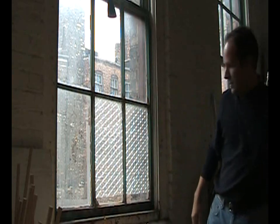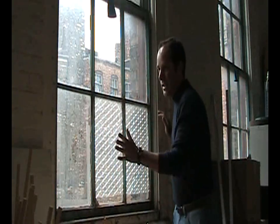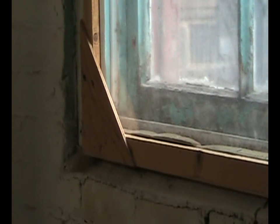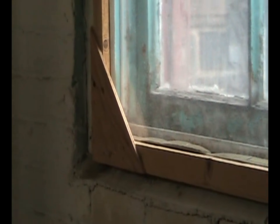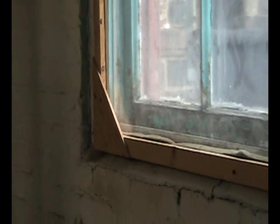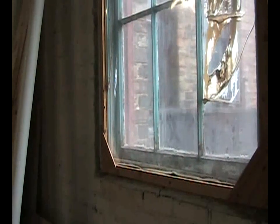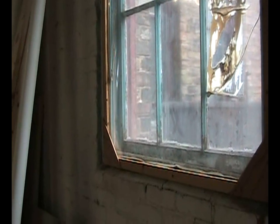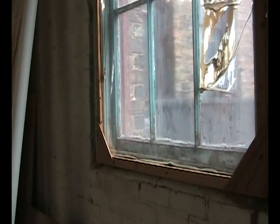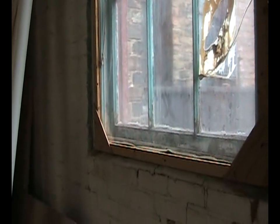The nice thing about doing this versus putting plastic over the entire window — and there are a couple of other windows in here entirely covered in plastic — is this: this is an example of a frame that's been created around those windows. It's just a wood frame supported in the corners with a pretty thick piece of plastic attached. This entire frame just bolts to the window frame, and as you can see, it locks down some pretty significant drafts. If the windows are drafty, this piece of plastic will billow in and out, but it works pretty well for making do with an inexpensive solution.